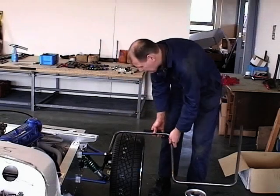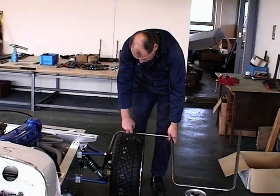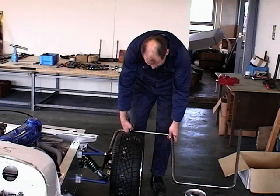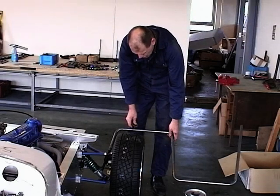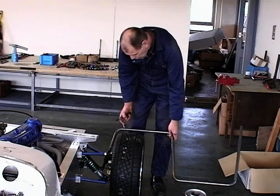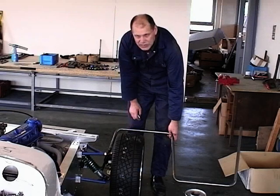And without trying too hard, can the camera see that? You can see that that again is virtually perfect. That's so perfect, it's unbelievable. So I think we want to get a gap there of round about 2 inches. So if you get a 2-inch gap between the tyre and the wing, if you've got bolts holding them on, then the tyre won't foul on the bolt head. And what it really means is you've got the perfect gap for the wing to sit on.